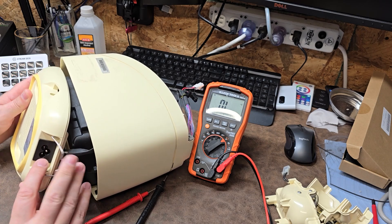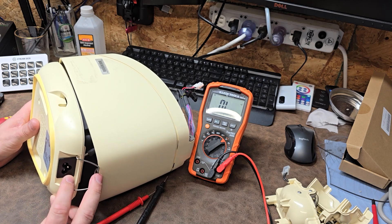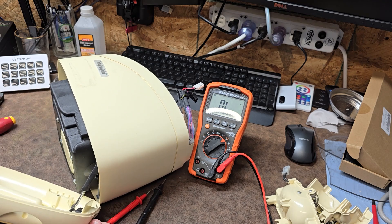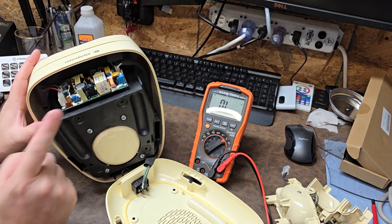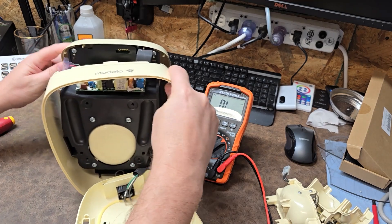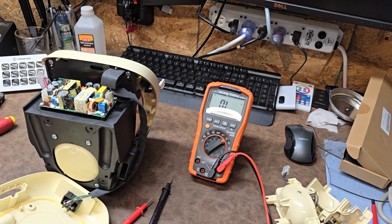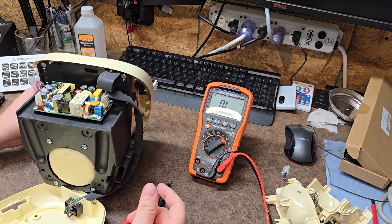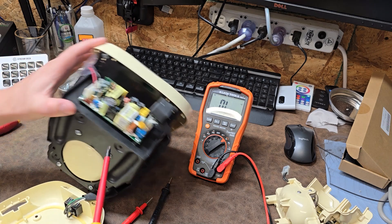I can see it's got a special IEC on the back. If you ever have one of these power cords and you're turning in a machine, do not turn in this machine with the power cord - save that power cord. Those things are kind of rare. It goes up and inside. Interesting - we have a DC switch mode power supply here. That would go along with what I said about it switching its power on and off with PWM. It's going to use this switch mode power supply to do that, and it's much easier to switch on and off DC power than AC.